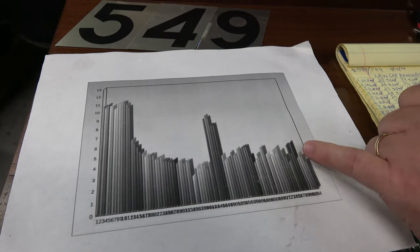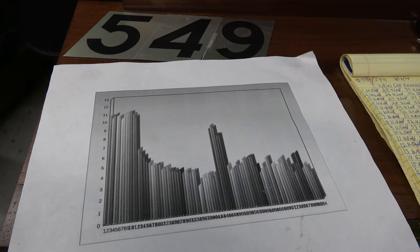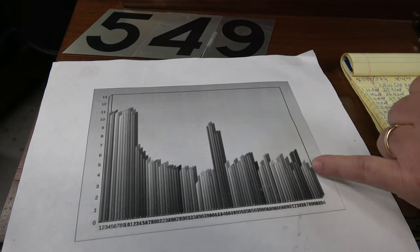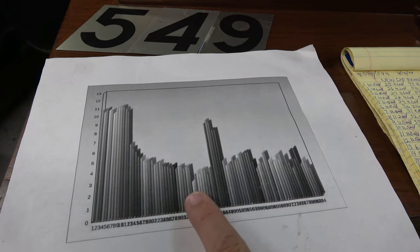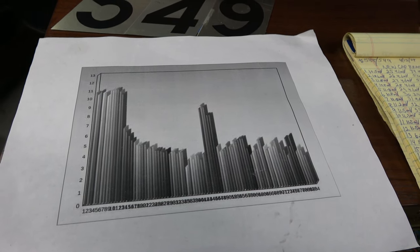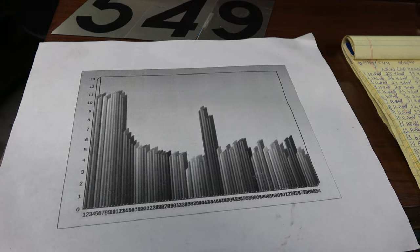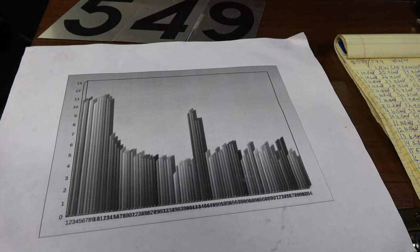It comes down and back up a little bit — there should be a slight arc — but a bunch of these are a little bit low. So what we ended up doing at the end was adjusting all these outliers that are a bit too low to bring those frequencies back in line. Otherwise you get a lumpy frequency response as you move up the chromatic scale, where certain notes are a little bit louder than others.